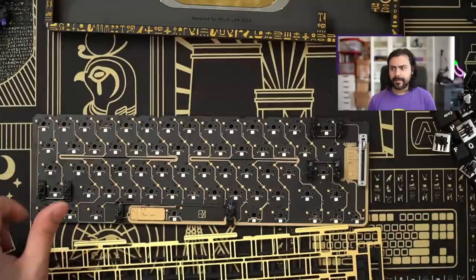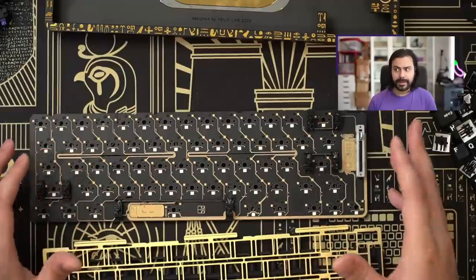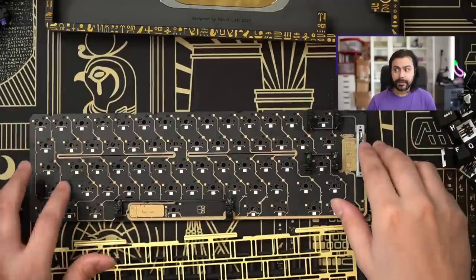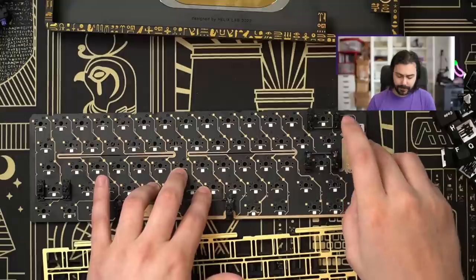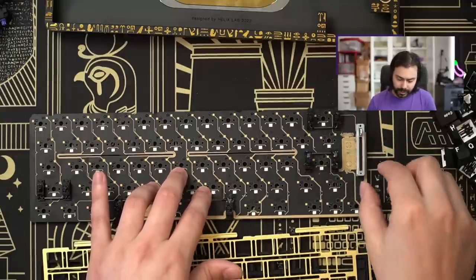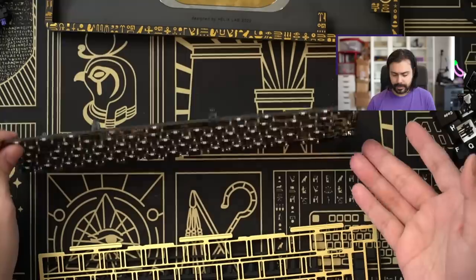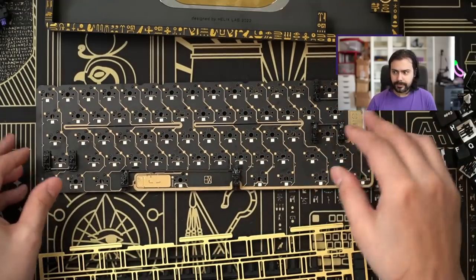And then the response was that all the faders are hand soldered. They can't be done via SMT because it needs to be inserted into the board instead of just placing it up top. The alignment is done with 3 pins and 3 corresponding holes. They've done what they can, but TLDR, they can't do much more in terms of alignment. Realistically, if you get one and you notice that it's not sitting perfectly flat, you could desolder and solder it. It's 3 solder points.